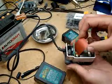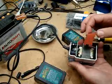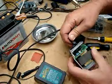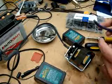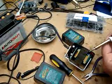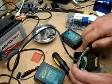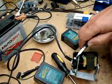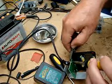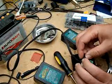First thing is there's a little piece of cardboard that separates the power transformer and the 120 volts from the circuit board. You don't want those to get together, so that's why that's in there. Don't lose that. Pull the thing apart, and all you need to do the job is pliers, a screwdriver to take the screws off, and a soldering iron. So what you'll do is get a hold of the electrolytic capacitor. I'm grabbing the leads. You can grab the capacitor itself. You pull on the capacitor while you touch the 2 connection points on the back side, and it'll pop right off of there.